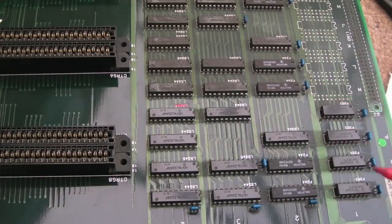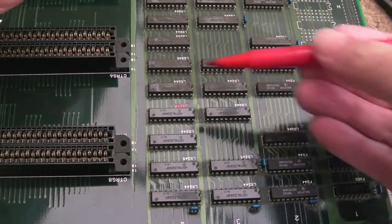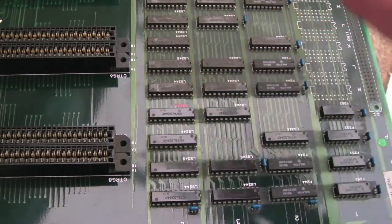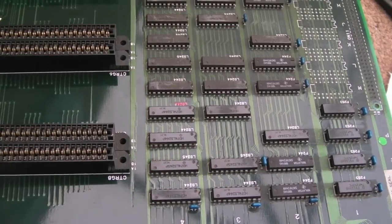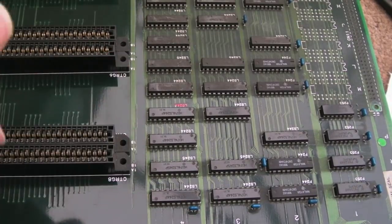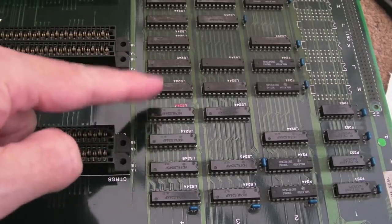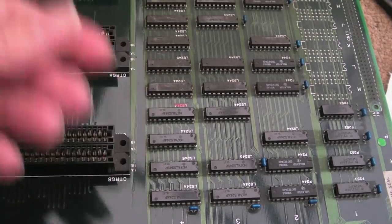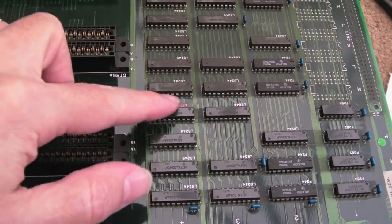So as I go around this, any areas like that I've cleaned up, and I've just scratched off the surface, you can't really see from this distance, I'm just marking it up so that when I finish cleaning this up, I know that I need to revisit here and do something with that just to protect it, check it. It could be a source of failure. Cleaning this up could also generate faults. I may find after I clean this up, come to test it, some slots don't work or it just doesn't work at all. So just as a reminder, let's revisit that area there, just make sure I didn't disturb it further, because there was some copper exposed there already, and the trace had all sort of bubbled up and gone horrible. That could have been on its very last legs, and me cleaning it could have broken the connectivity there. So anyway, it's just a reminder.